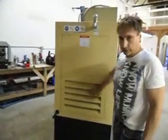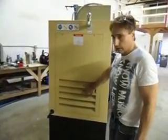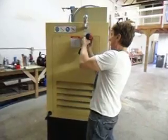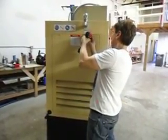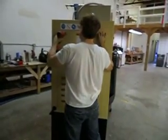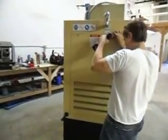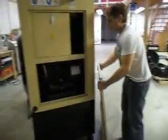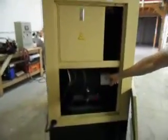This is the electrical panel side of the compressor unit. Here is the ventilator for the intake vent — it exhausts air out the top. Inside there is more convoluted foam. With the panel off you can see the side of the motor. There is one screw to adjust belt tension and it is spring-loaded, so as the belt wears it will automatically adjust within reason.